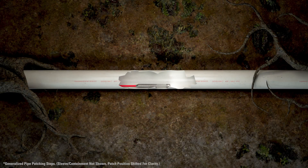This will ensure you can get your packer to the desired area and have a better chance of pushing it or pulling it through the line. Once you've re-inspected and confirmed the measurements, you will perform a test insertion by ensuring the packer can actually make it to the desired location.